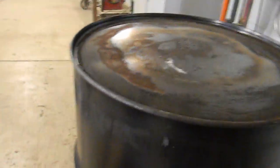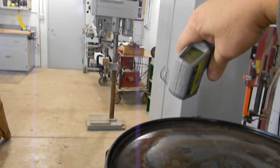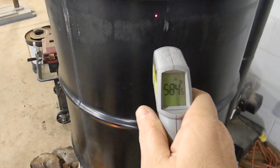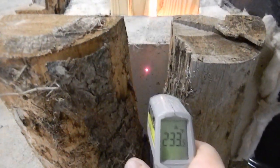My infrared temperature gun goes to 800 degrees — and that's over 800 degrees right there, it won't register anymore. Coming over here we're at 590, almost 600 degrees. As you go down: 384, and at the very bottom we're still at 180. On the other side we're usually around 220, and the concrete refractory here is 236, so you can pretty much burn yourself on everything.